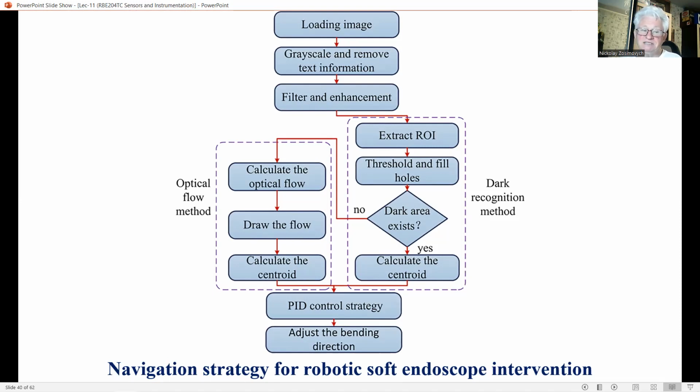The path may consist simply of a contrasting line on the floor. An LED or other light emitter casts a light beam down to the floor, and 2 detectors on either side pick up the reflected light. The vehicle is controlled in such a way that both detectors receive the same light intensity. In other words, when they are equal distance from the reflecting light.